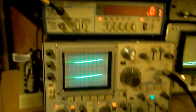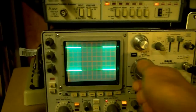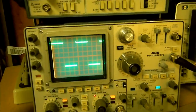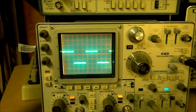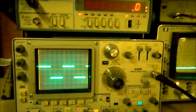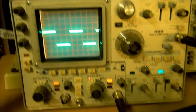It even appears to be working correctly — and I actually know this one is. If it won't do all of these things; if you can't get a trace, can't get something steady on it — let's go back to channel two, one kilohertz — if you can't see something like that then it's probably not working. That's not going over all the features of an oscilloscope, but it covers the main functions to see if it's working at all. If it's working that well, it's probably okay — so you might want to make them an offer. Hope this helps.